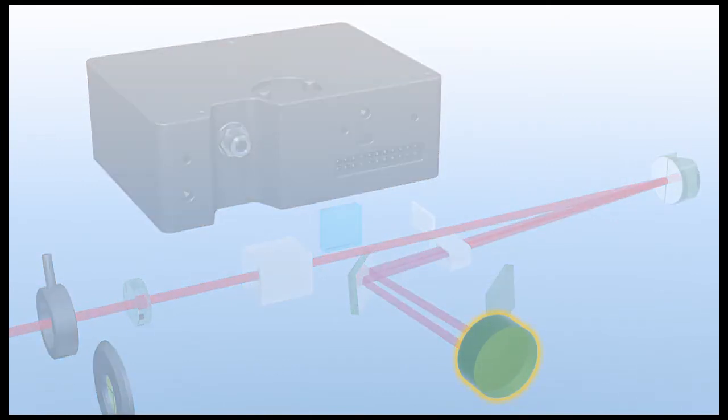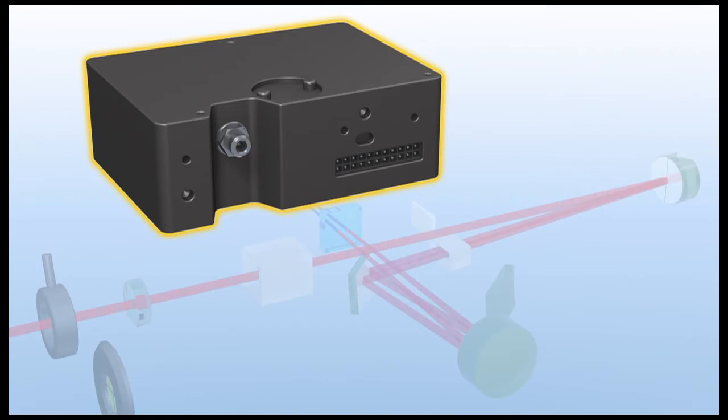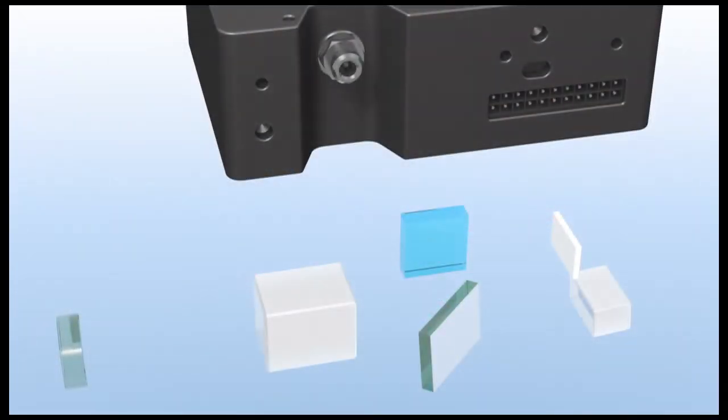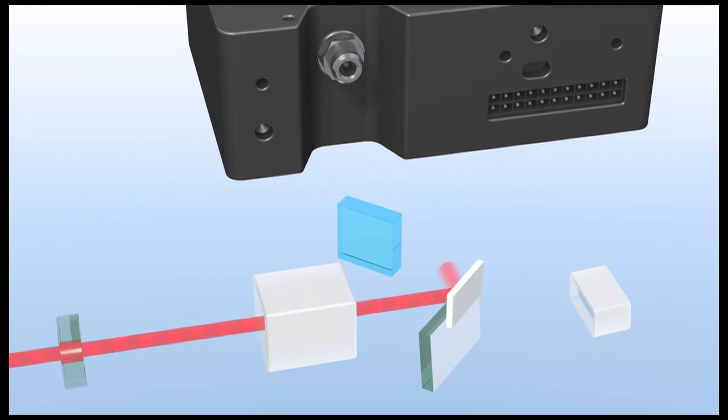After alignment is complete, LX Spider automatically moves the alignment mirror out of the way. This allows the two beams to strike the focusing mirror, then merge at the entrance of the spectrometer for a sensitive phase measurement. For a robust measurement of the pulse spectrum, a diffuser can be turned into the initial beam path. Its innovative design allows for a more compact size and full automation.